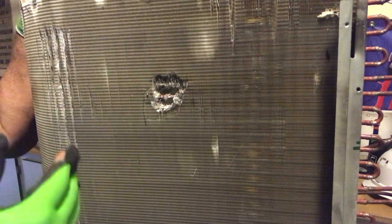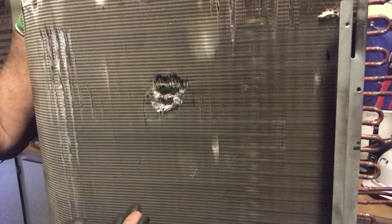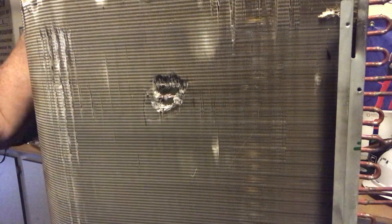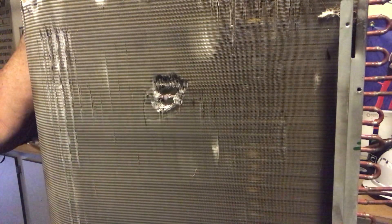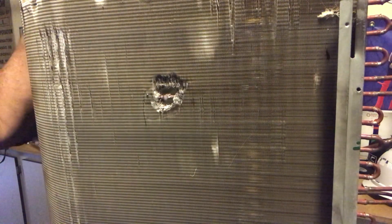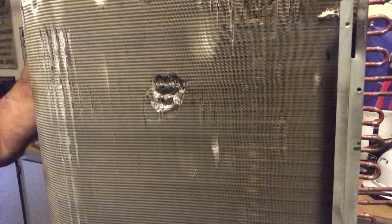This is how I go out in the field when one of my techs has driven a screw into a coil — this is how I work with them, train them, and show them how to fix a leak. A lot of times guys are afraid to get into a coil, afraid to heat up the aluminum, but this is one way to do it. So again: the ASCO torch, the Big Blue brush-on micro leak detector, and the 15% silver solder round rod from SolderWeld. As always, work safe, be safe, be good humans — we'll see you next time.